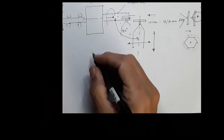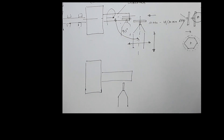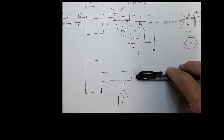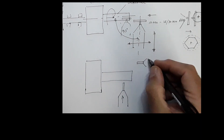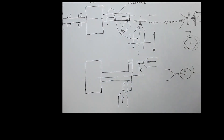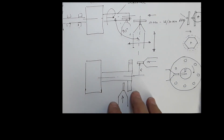Another thing you can do is fit a normal drill in the Dremel and go in to drill a hole into the object. You can also rotate the Dremel on the tool post to a different orientation, or offset it. For example, on a part with a large flange, you can come in at a specific radius and drill a hole, then after indexing drill another hole, ending up with many holes evenly spaced around the circumference.